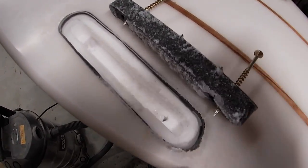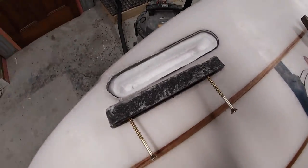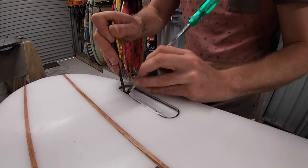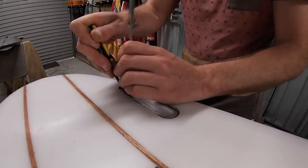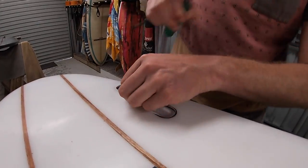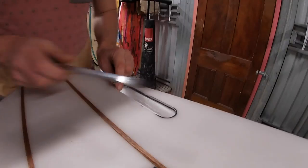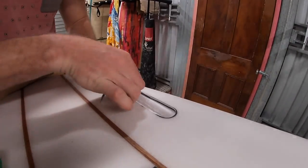So it's out and all we're left with is a little plastic border from the flange of the box and we're going to pull that one out by hand. Just prying away with a couple of flathead screwdrivers, being gentle. We don't really want to break the fiberglass above that flange. We want to keep as much of the good fiberglass intact just to save ourselves repair work later on. So just keep prying and peeling - be slow and gentle and pull it out.